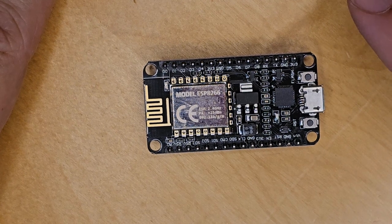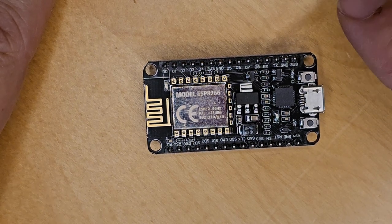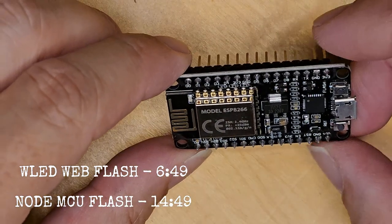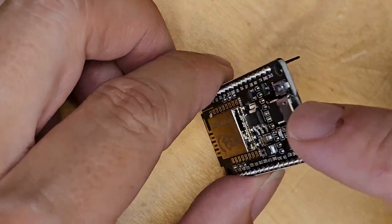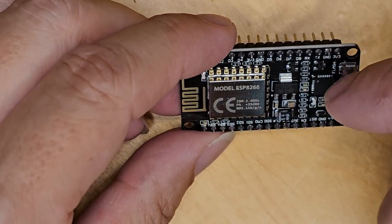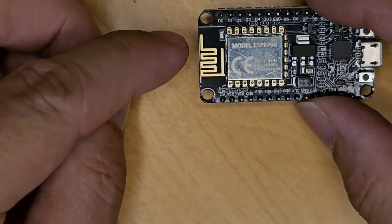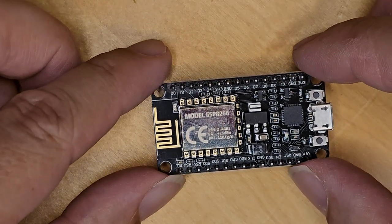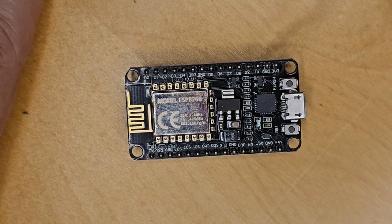When I first bought one of these chips I had a hard time getting it to flash, so I'm going to go over a couple of different options for flashing these devices with WLED — something that hasn't been covered in too many tutorials. I'll put a link in the description to the timecode if you want to jump to that section. The ESP8266 has a USB connector for power and flashing, and it has built-in Wi-Fi: 802.11 B/G/N operating on the 2.4 GHz band. This here is the Wi-Fi antenna — I've soldered an extra wire on there to extend it on some projects, and I can access all my devices from anywhere in the house.